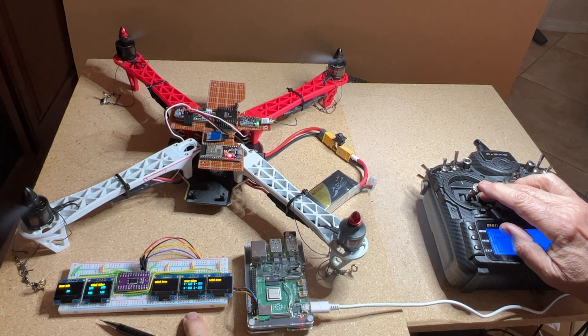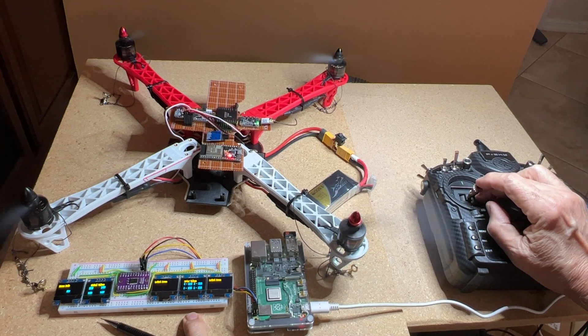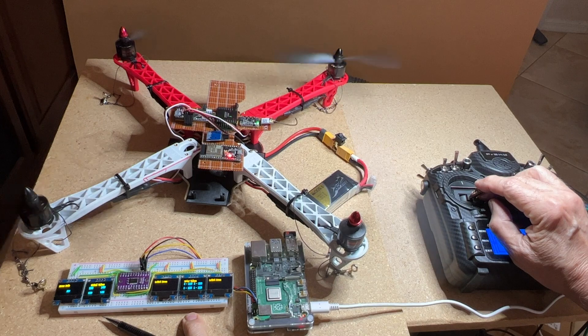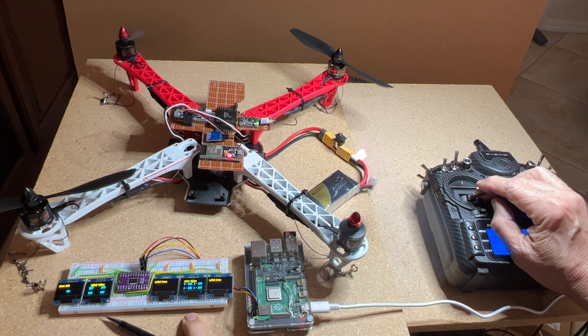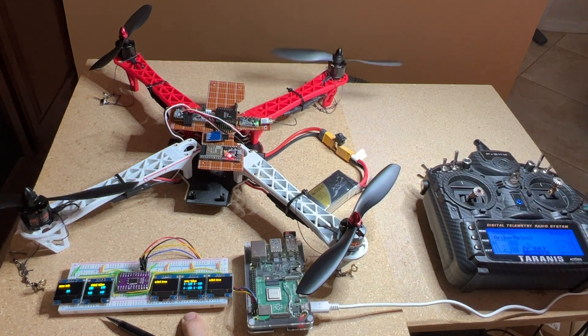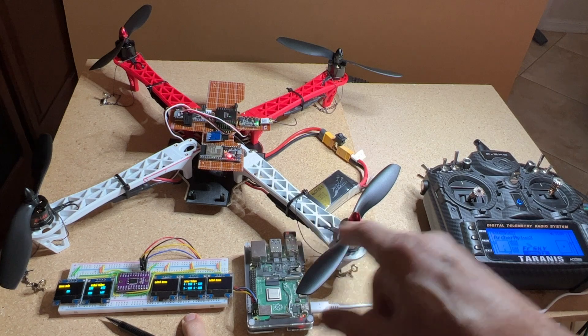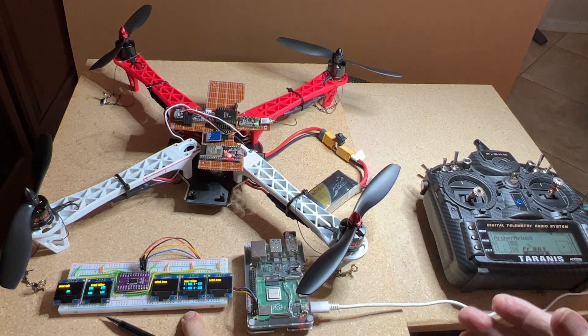I've started to put in the yaw, pitch, and roll with extremes — way extremes — just to give you an idea. If I take the rudder one way, you'll see that motors two and three speed up and the other two slow down. Normally it would be a smaller percentage than using the max. If I go the other way, you'll see the other two do that. I will have the same kind of effects for the pitch with the bottom two motors versus the upper two, or the roll with these two versus those two, depending upon which way I'm going.